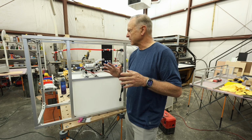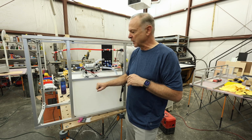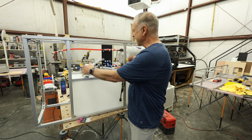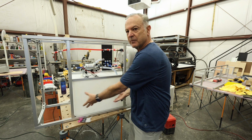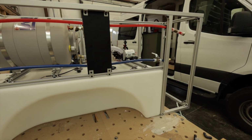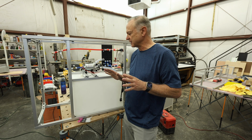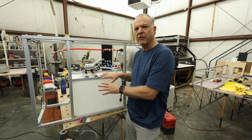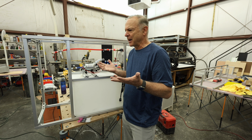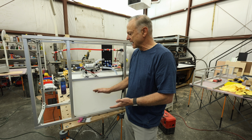So now I just want to give you a quick overview of how our system works. One thing we do differently is we used to use just a regular water tank that we put up above the wheel well, and then we put our parts down below. What we do now is we use an over the wheel well tank, and this is a 36-gallon tank. I'll put links to everything I talk about in the description. 36 gallons adds up to probably around 250 pounds once it's full. It lowers your center of gravity, which is really nice.